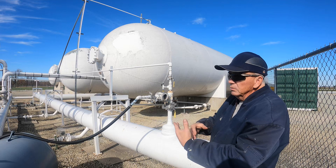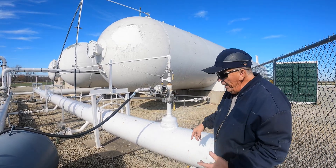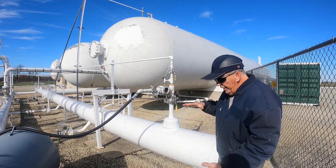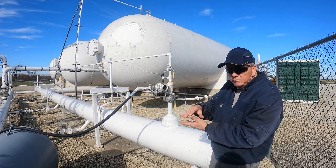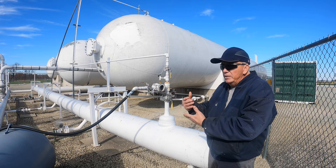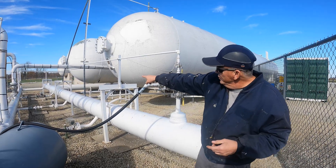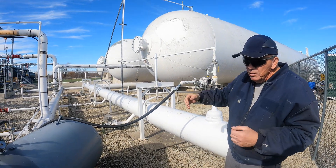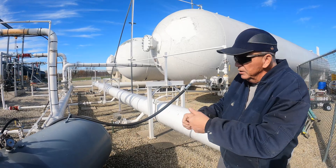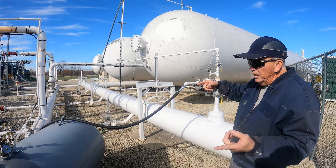When building vapor piping like this, that elbow is almost an inch higher than the shutoff valve, so vapor goes up and then slowly angles down toward the tank — any condensate will make its way down to the tank. We want to keep this as full of vapor as possible. As liquid comes rolling out of the rail cars through the eight-inch pipe, it dumps in here and makes its way to the tanks. The vapor pull-off lets more and more liquid fill that trunk line efficiently, so liquid isn't always competing with vapor for the same limited space.